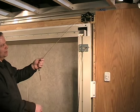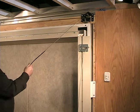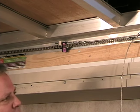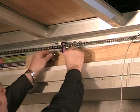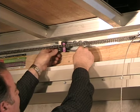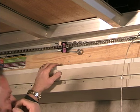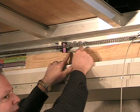At that point, you're ready to pull the cable through the system. Once the cables are attached to each other, simply take the cable and pull it through the opening — it will follow through all the pulleys until the head is locked into the bracket. Take the eye bolt, put it into the bracket, and place the nut on it. For long rooms where you have a lot of space between your brackets and your pulleys, you can put the nut on about three-quarters of an inch — this nut is seven-eighths of an inch long, so give yourself some threads. On shorter rooms, you'll want to use more thread but leave yourself about an inch of adjustment stud on the outside of the bracket.